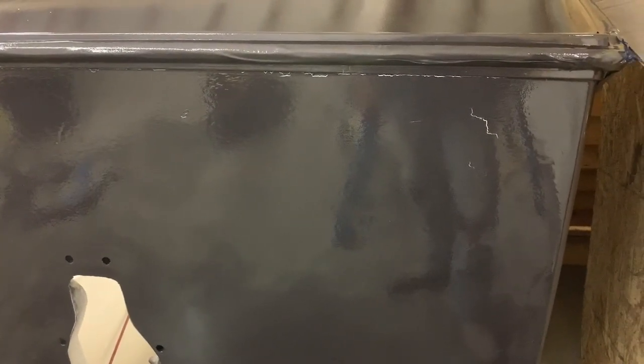I have a feeling I used a one part epoxy on the base, for the very base, to cover up the polyester filler below the water line. But I just went ahead and did the whole thing, and I have a feeling you have to cover that up with a surfacer before you put this automotive paint on here. And I have a feeling there's some areas right there where that one part epoxy is exposed, and there and there. There's no other places right now, and those are fairly easily fixed. It's not that big of a deal to fix those.